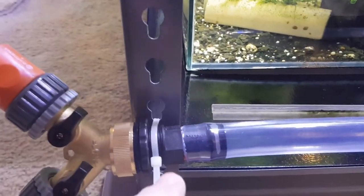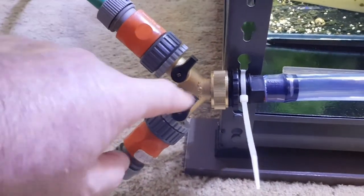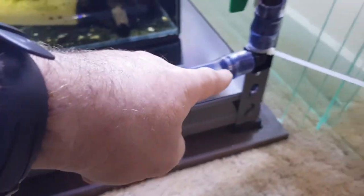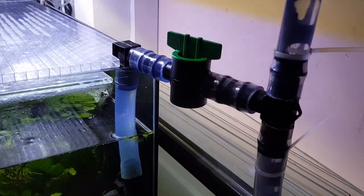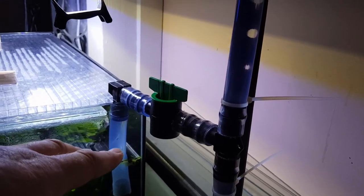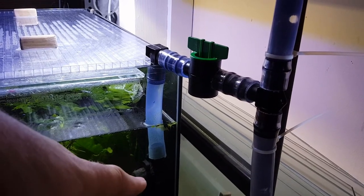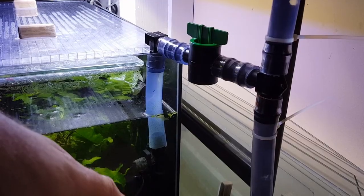No leaks, nothing. As you can see, I have a join that's just a normal tap fitting — a Y-fitting that fits on garden taps — with a spigot that joins into the top, fitting my 20mm pipe. I use elbows and basic tap fittings, nothing flash — all simple irrigation fittings. I use clear piping so that if there's a bubble anywhere or any problem in the water, I can see it, unlike black irrigation pipe where you can't see anything.